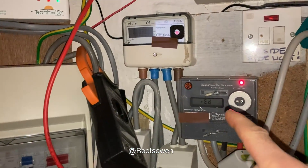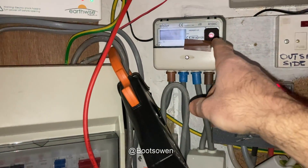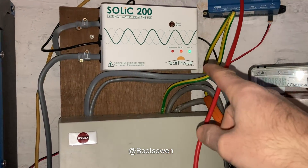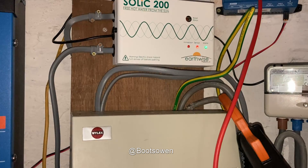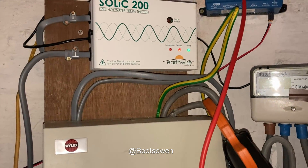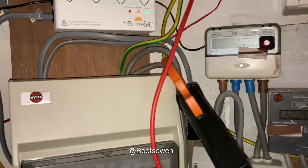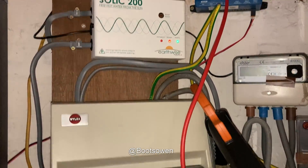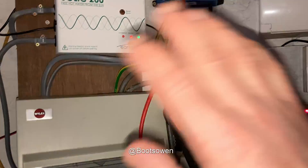It's maybe 15 minutes later and we're still doing one kilowatt from the inverter. The house is drawing 700-800 watts and 200 watts is going to the grid. Down in the cellar: both lights have gone red — we're at an equilibrium, but actually we know it's exporting because we saw it on the display upstairs. The Solic has gone off; the sensor's red, which means it thinks we're not exporting. The tank is stone cold so I can't imagine the thermostat has tripped. I really don't know about this Solic. Questions or comments, leave them below — thanks for watching, see you later.